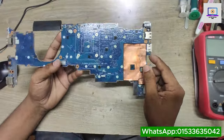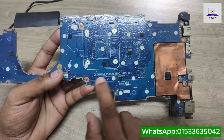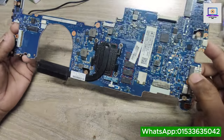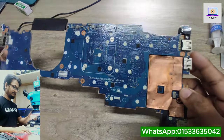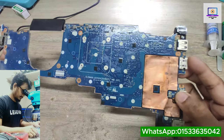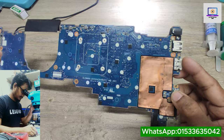Okay, so this is the motherboard — as you can see, this is the motherboard part number. First I will do a visual inspection on this board for any shorted parts, discolored capacitors, or blown components, and then I will check all the required voltages step by step.